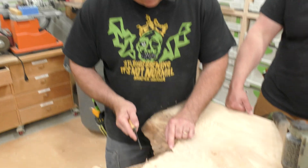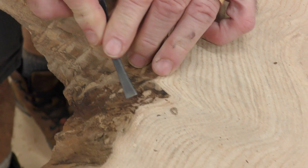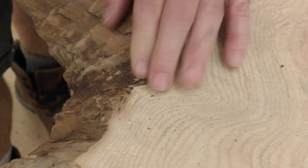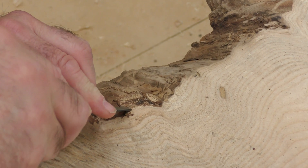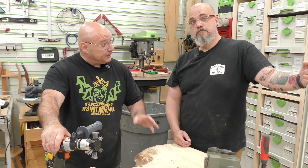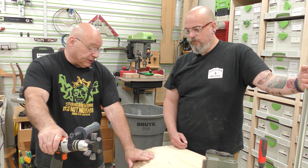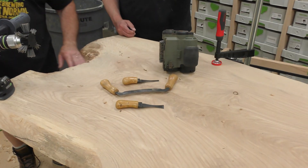There are little areas in here where I'm going to use a chisel, but I've got to be very careful not to break anything else out. There's some nasty cambium fibers in there. As I said at the beginning, there's going to be a series of tools — especially when we get into these nooks, crannies, and little undulations. We hit it with the Restorer, came in with some chisels.